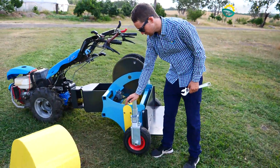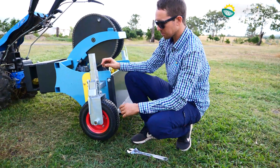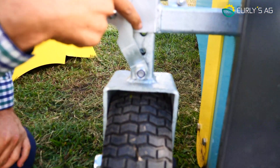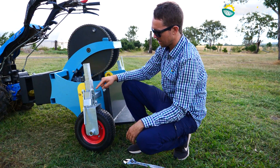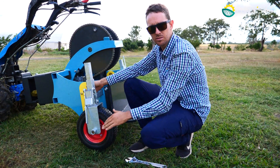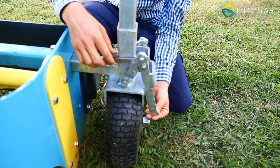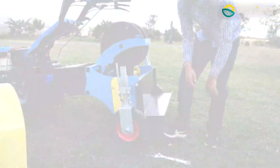For your wheel operation: this has a variable depth setting, so you don't have to crack to the bottom of the fork every time. It's got three depths you can set it on, depending also on the elevation of your bed. Currently it's in crack mode with the wheel fully down, which lowers your fork. When you want to drive, get this lever around the front, lift it up, then push it up and over. Now you are in drive mode — this is for transporting it around the farm.